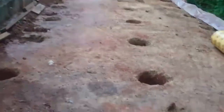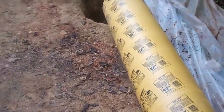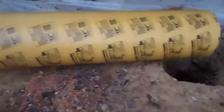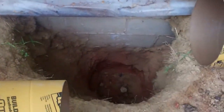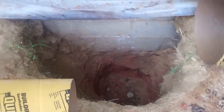Good news — we have passed our footing inspection, or at least the depth part. So now we've got to get a few more of these tubes. These are 12-inch diameter for the concrete, but mostly for all of these holes along the wall because the dirt was just not packed down enough, and like here it started collapsing in on the sides. So we're going to put these tubes in, then put dirt around them, and then fill them with concrete.